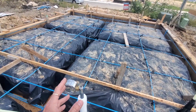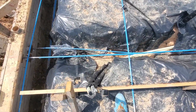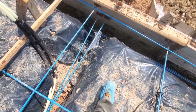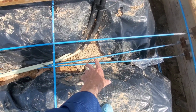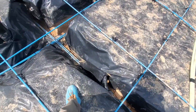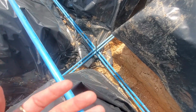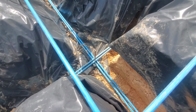So not too bad, but I came in and did my inspection and saw a few other interesting things. Over here you had a cave in. This has completely caved in, man. This side has reduced the depth of your beam a considerable amount, by more than half. Your vapor barrier here is torn. That needs to be patched back up. Over here, you can see that the tendons in the bottom of this beam, they're on the ground. Somebody stepped on them right here and they got pushed down. Those need to be lifted back up. The plans aren't here, but it's typically 6 inches.